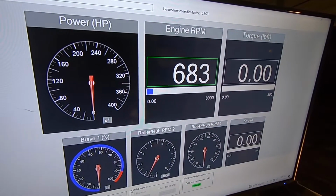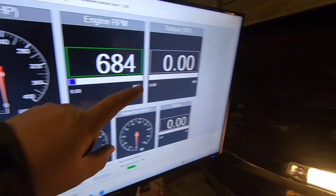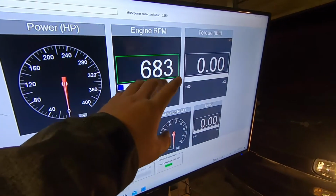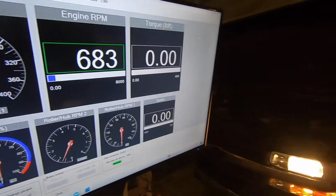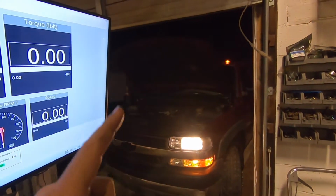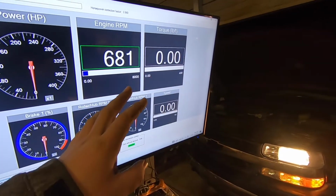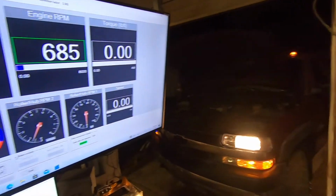All right, so this is working fantastic on the old Isuzu Commonrail here. Interesting thing is, it's not picking up the pilot injection. So I thought I'd actually have to divide this by 2, but apparently the pilot injection pulse is so small that it's not picking it up. And if you don't know what that is, I can explain that in a different video.